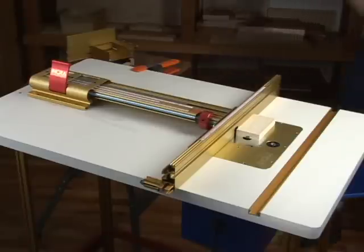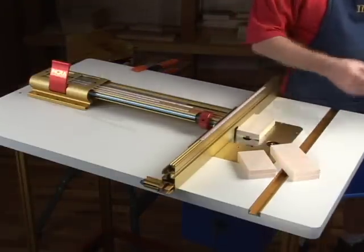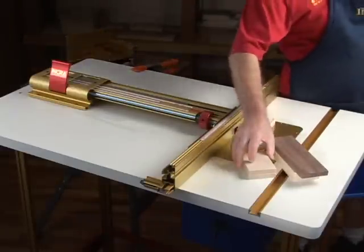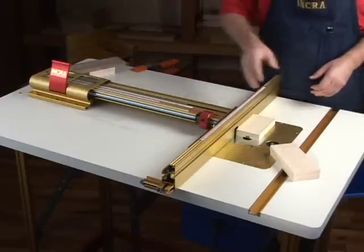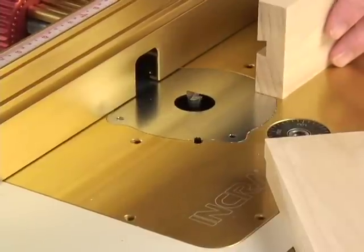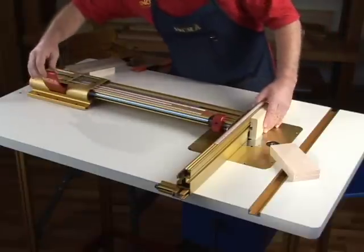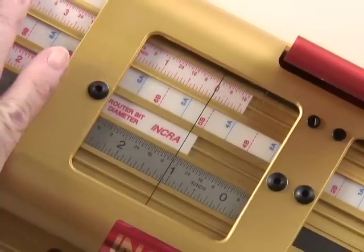For this decorative joint, you'll need the same four pieces required for any half-blind joint, plus a piece of contrasting color stock about 8 inches long to make the corner post. All should be the same thickness and width. After centering and installing your selected dovetail template, set the fence to a scoring pass position and lock the carriage. Slide the Lexan measuring scale to read zero under the cursor.